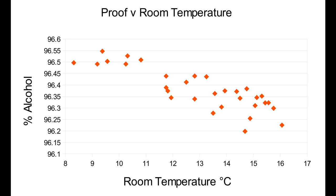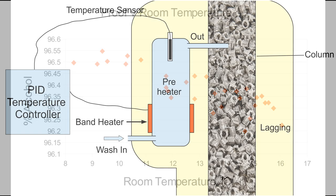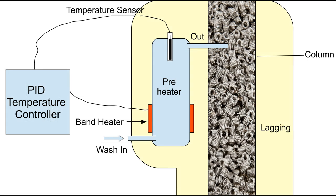I guess that's old hat, but have you ever seen it demonstrated this close to the azeotrope? Back to preheaters: when a column's performance is marginal, a preheater helps. Large scale columns usually are marginal because you don't want to pay for and maintain a longer column than you need. But on the scale of my small continuous still, it is simpler, cheaper, easier, more reliable and in particular less prone to dangerous failure to ditch the preheater and make the stripping column generously long to compensate.